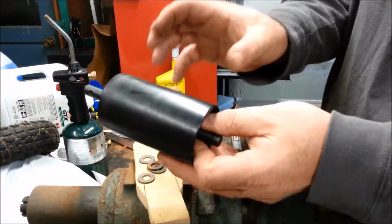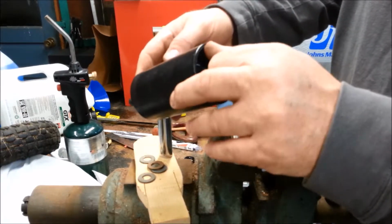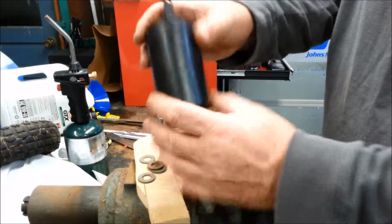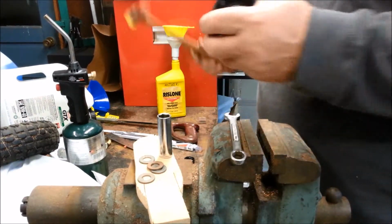on the shaft, which means the inner race is squeezed together on the shaft relative to the outer race. And I want to relax that a little bit. Now I drove it together this way. I'm going to tap it back this way a little bit, and I should be able to get just a little smoother shaft movement.